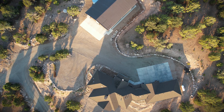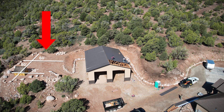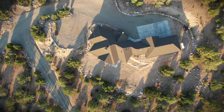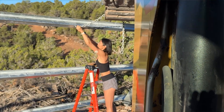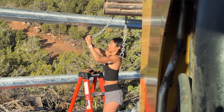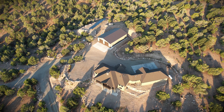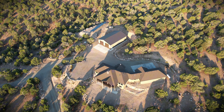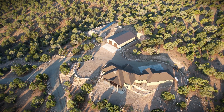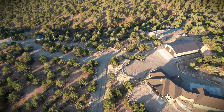The terrace was made from the excavated barn dirt, and that gave us this very large flat area that we needed to put the array on. I was really struggling with how I was going to mount the array and have it up high enough to be above the tree level so we don't get a drop in production because of shadows. So building the barn and the array at the same time gave us the dirt, the elevation, and a large flat area that was much easier to mount the solar array on. And all of the adjustability gives us the flexibility that we need for our production to be high all year long.